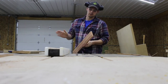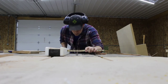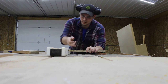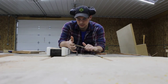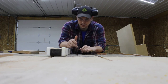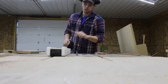We're back at the table saw to cut the final width. We want three inches finished out, so we'll set the fence. I like to use these folding rules — they're easy to use. As I'm doing this, I am measuring to the inside edge of the blade. Depending on your table saw blade, you may have teeth that rake one way or the other — make sure you're picking a tooth raked furthest toward your fence. The reason is your blade has a kerf width — in this case a sixteenth of an inch — so if you measure to the outside of the blade, you'd be a sixteenth inch shy on your width. I've got it set to three inches and the fence is locked.